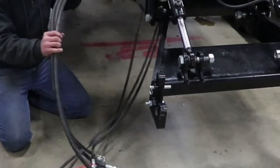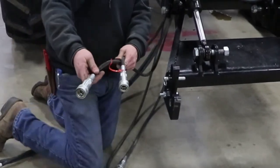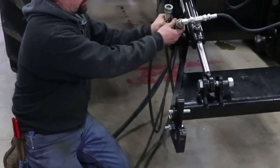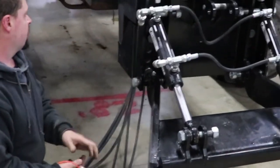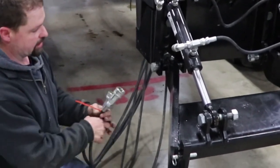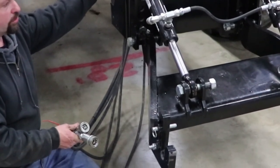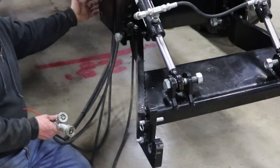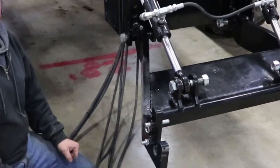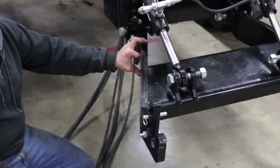One thing I'd like to mention is we have one pair here, and you'll notice that one hose is longer than the other — the reason being one hose will hook on to this end of the cylinder and the other hose will hook on to this end of the cylinder. We supply those with Pioneer couplings; they simply plug in. Of course you'd run these up and route them over top or through the center to keep them suspended up out of the weeds. This enables you to keep your hoses on your tractor, put your weights back on if you want to, and use your weights in the field. At that point you only have to take apart six bolts — two guys can pick that up and set it off. If you have a skid steer or a forklift handy, that works well too. It would take you about 10 minutes to take that off and about 15 minutes to put it back on.